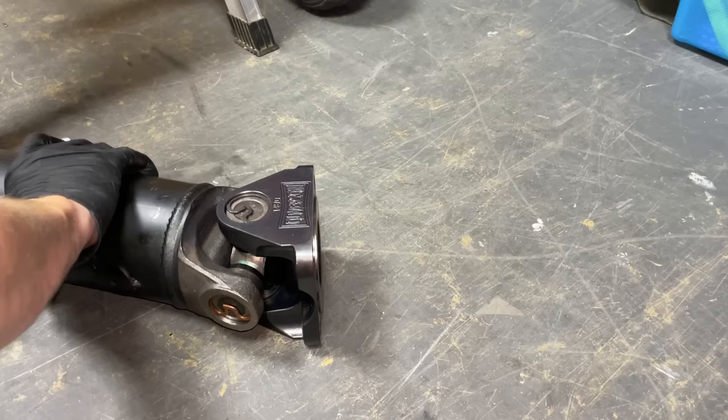The way the breathers are set up, when you're doing a donut, you're just firing oil out. It's mostly the way you've got them set up on it. It's pouring oil out when you're doing it. If you look how much oil's come out of it now. Oh no, I kept it all grease free. Now it's a mess. I'll go and get some granules and put them on that and we'll have a look. Because when you was doing it, it was pouring out.